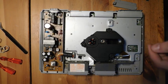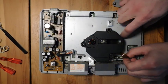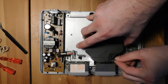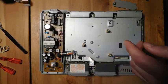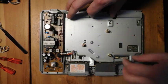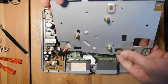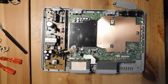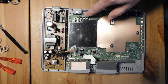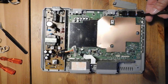Now we're going to go ahead and remove this cable here — this is for connecting the power supply board to the logic board. We're also going to remove this guy here, which is just friction fit into place. Those are the two sets of cables that connect the optical assembly to the logic board. This little cable here is for the controller ports. Now we're going to go ahead and remove the upper portion of the RF shield. Sony helpfully puts arrows where all the screws are located, so later on it's easy to put things back where they belong.